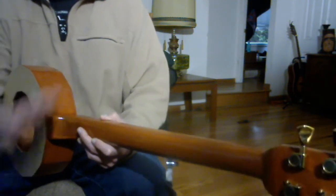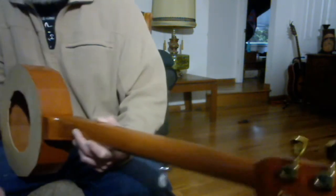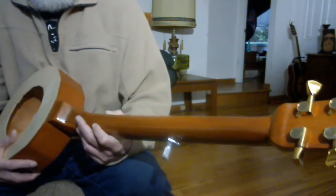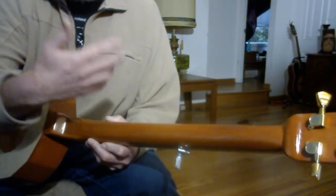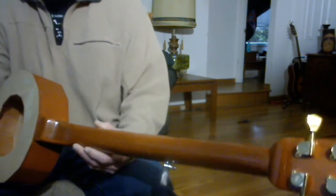What I did is I used a full cut of shellac right out of the can and put it over the whole banjo. After that dried, I sanded it lightly with 320. Then I put the stain on, let it soak in for five minutes like you normally do, then wiped it completely off. After that, it did not have a rich deep color — it was very weak because the full cut of shellac prevented the stain from absorbing into the wood. A lot of the blotching was gone, but the color was still uneven.